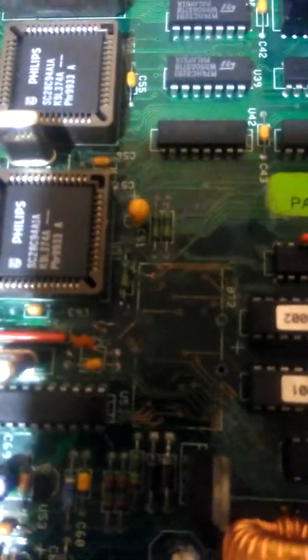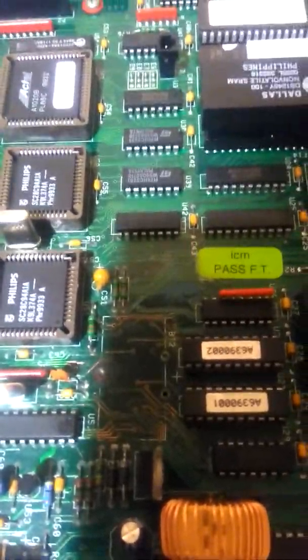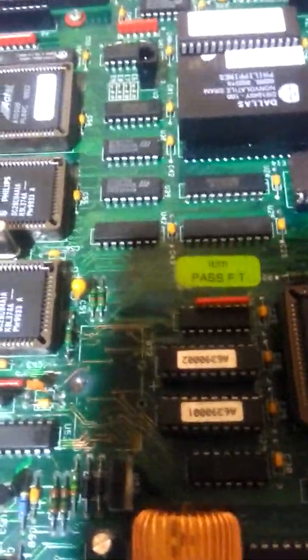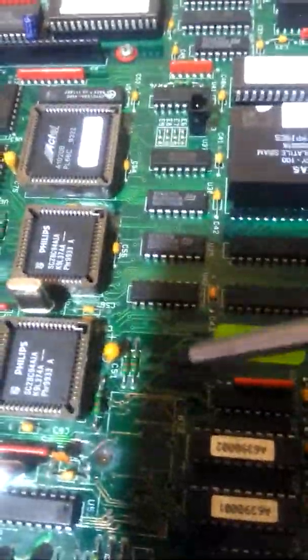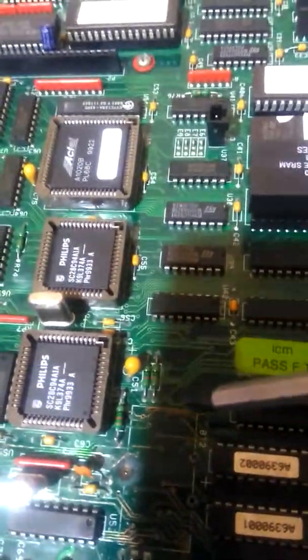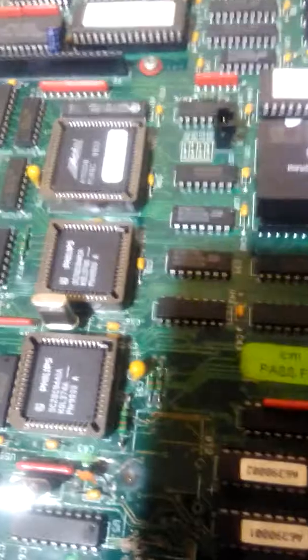This area here is bad on these because it causes a lot of issues. You can see it looks nice and shiny and clean now. A lot of those have been bypassed on the underside of the board, which I'm not going to unscrew and show you at the moment, but it's pretty basic. Use your multimeter on ohms or diode setting and just follow those tracks or traces — basically your copper traces on your boards. These are double-sided printed boards, so where those wee little tiny holes are, the track will follow through onto the other side and continue onto another circuit, diode, resistor, or whatever.